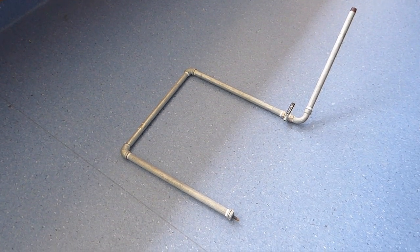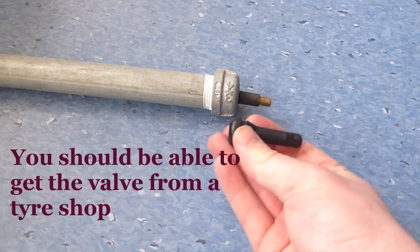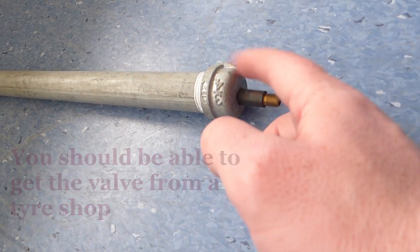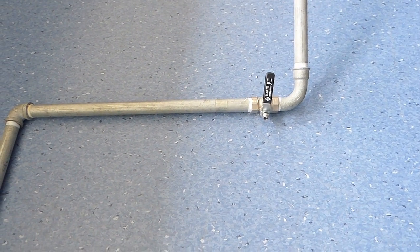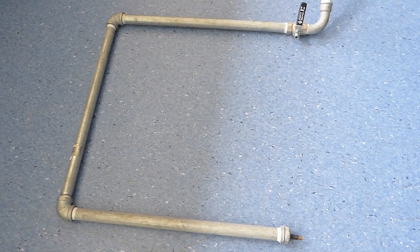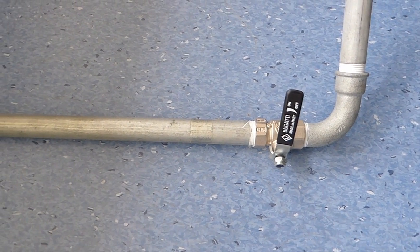Here you can see how it all fits together. Starting with the round end cap, there's a valve — a bit like this one. There's a hole drilled in the end cap and then the valve is pushed through. I think we used araldite on this one to secure it. Then just use PTFE tape or plumber's tape on the joins and screw it together. I find this U-shape for the chamber that stores the compressed air works quite well in terms of stability — when it's outside you can rest a foot on it. There's the quarter turn release valve — that's open and that's shut, ready for the compressed air to be pushed in.